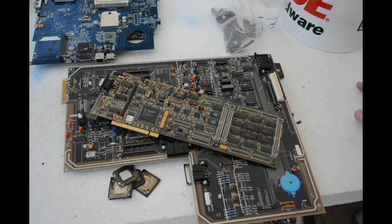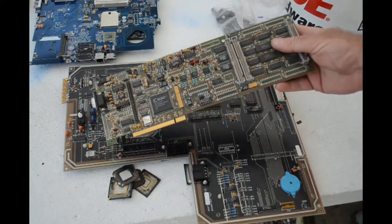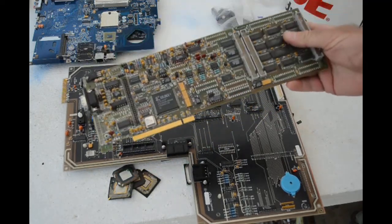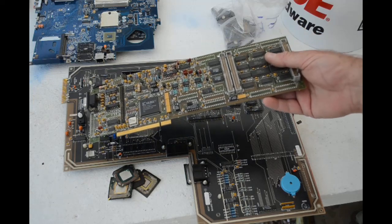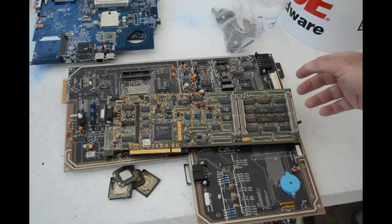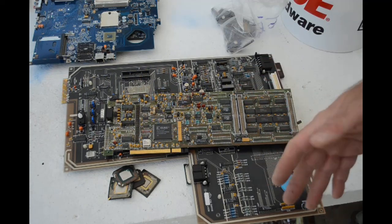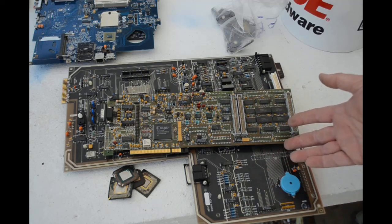And by the way, the kiln, you would think it would be very destructive, but what happens is the kiln warms up to the point where the solder melts and the parts fall off the board. And they fall to the bottom of the kiln where I have a catch basin. Well, the temperature in the kiln is stratified. It's hotter at the top and cooler at the bottom. So once the parts fall off and fall to the bottom of the kiln, they're in much cooler air, much cooler environment. And they don't sit down there and cook.